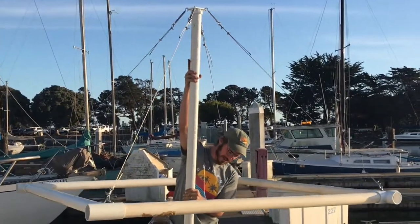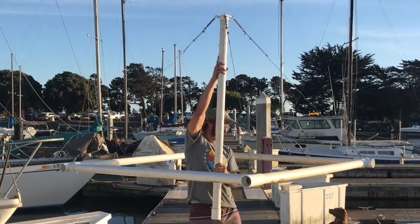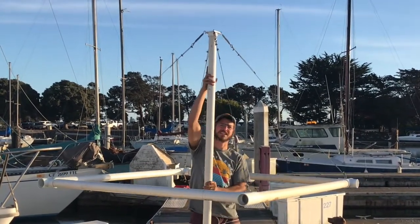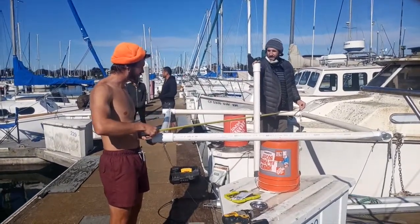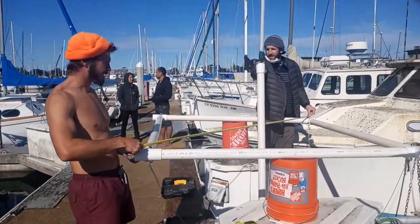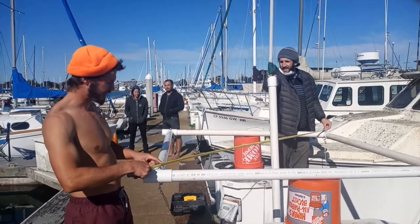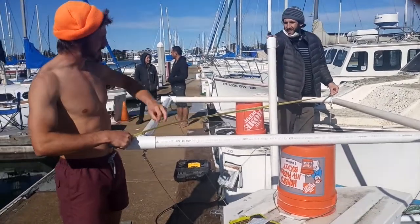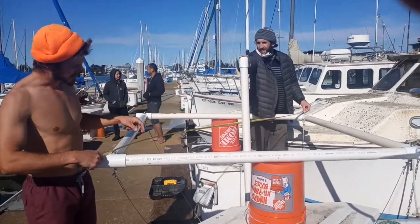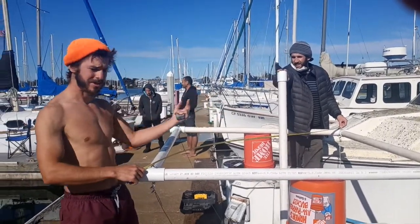So this will just kind of sit here suspended between the top and the bottom. Perfect tensegrity structure. Alright, so the diagonal is about 85.5, and right now we've got this upside down. We're measuring this to get the length for the cable that's going to be the bottom of this octahedron. We're just going to make it a straight X across, and then when we actually tension it, it'll come down and give it that three-dimensional shape.